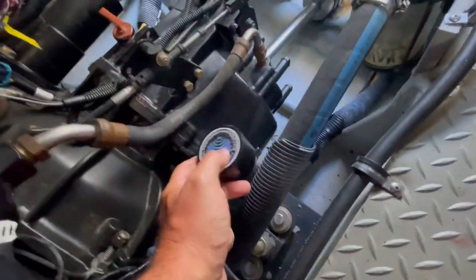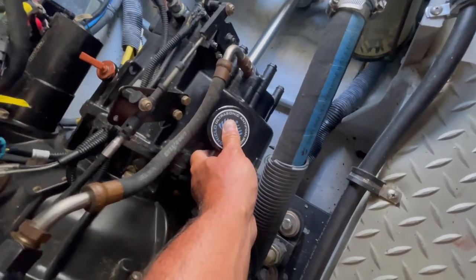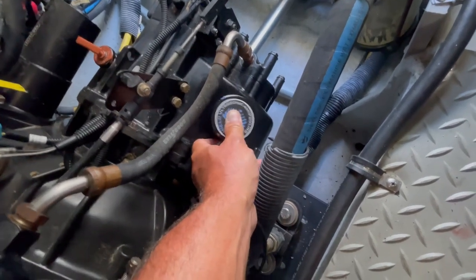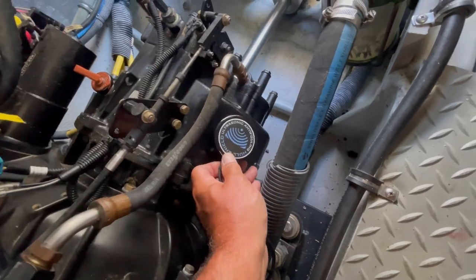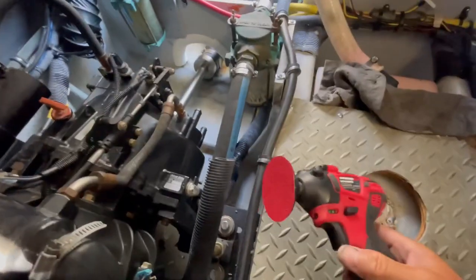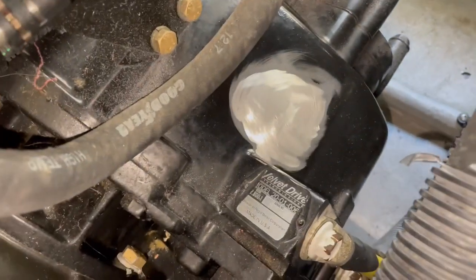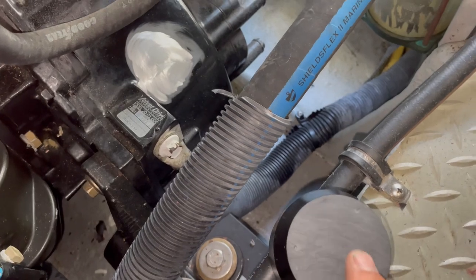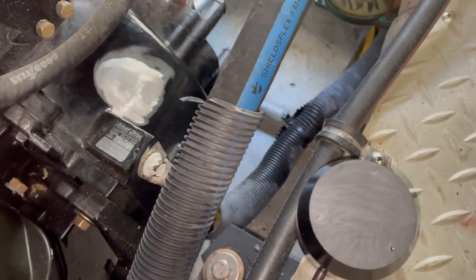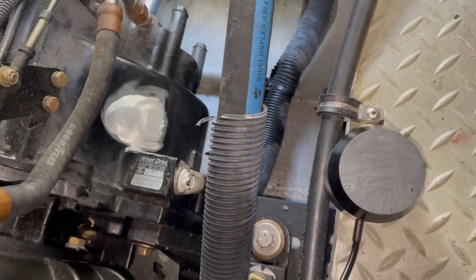To give you an idea how the puck will mount here on this flat surface, you need to find a relatively flat surface that doesn't wobble. Once we get the JB Weld in there we'll secure it right around here. We'll use a small sanding disc to sand that paint away. We got that cleaned up nice and shiny. You also need to scuff up the bottom of the transducer with medium-grit sandpaper, then clean both surfaces with carb cleaner and wipe with a clean rag.